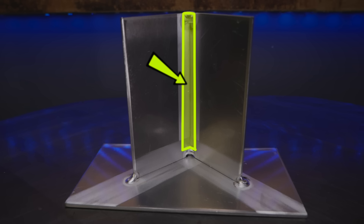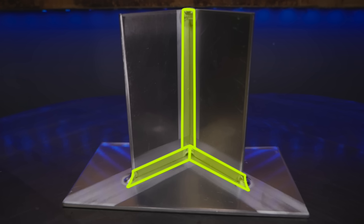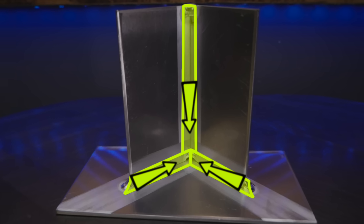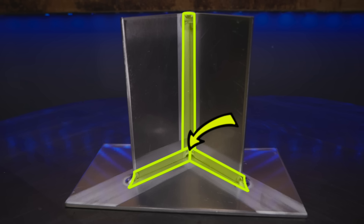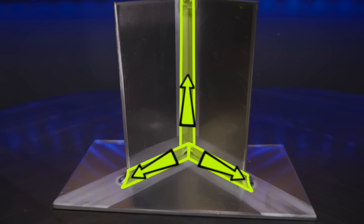Consider this instead: if we plan to start with one pass first, the next one going over top will hide the button or start underneath — good planning. Sometimes we have no option and must finish in the corner, so I'd recommend pointing all welding towards that corner for good direction consistency. Starting in the most problematic area gives us time to make sure each pass starts properly to take care of any blending problems in the pocket, then you plan what to do with your buttons as you point them in other directions later.